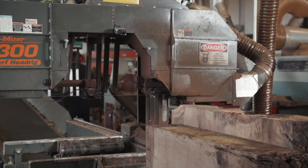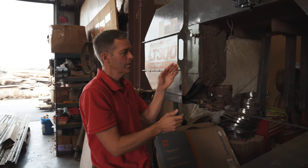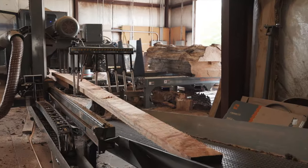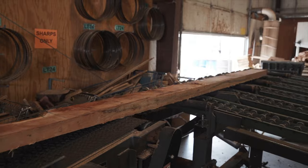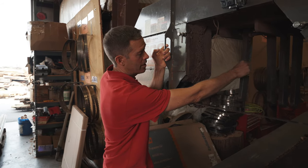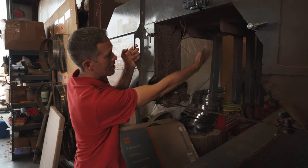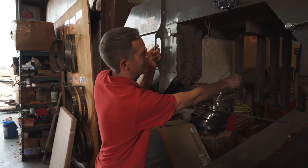We've got 28 inches between the guides, and sometimes we can cheat a little bit and get a little bit wider. It's got some neat features on it, like the board returns. You'll notice on the videos the board will just magically push back and hit this conveyor down here — that's what these board returns do. And they bang around, and that's inch steel. If you notice, that one's kind of bent to the side, so there's some significant force that happens here occasionally.